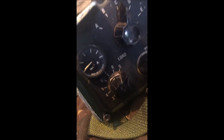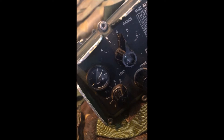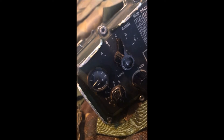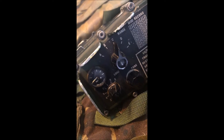And I was able to tune. I'll have a bit of a look here. So I was able to tune up on the C9 position. On the C9 position I was able to get it to tune nicely there. So that tuned up just like it was an antenna — a bit of a mismatched antenna at 470 ohms. And I was able to simply go C9, click, click, click and find it and then tune it up with the tune.